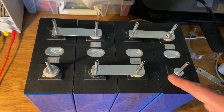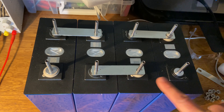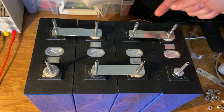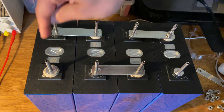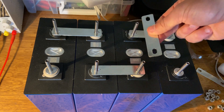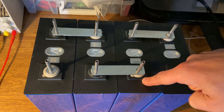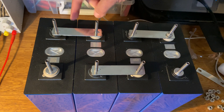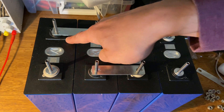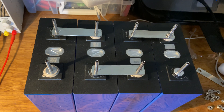When doing series, make sure cells are lined up with alternating polarity — positive, negative, positive, negative — and that you're weaving one zigzag line through all the cells. Don't accidentally connect things that shouldn't be connected. Each connection should always be between alternating colors: white to black, black to white. A simple way to think about it: parallel means same colors connected together; series means alternating colors connected together.